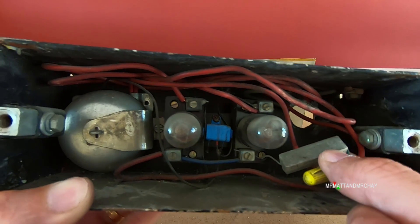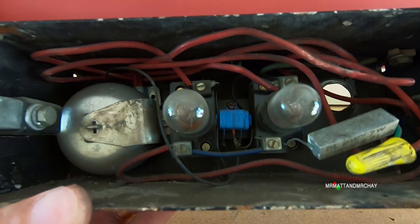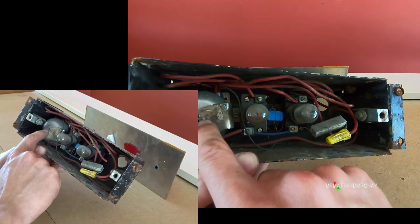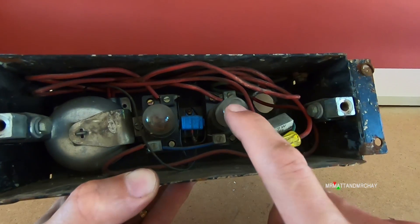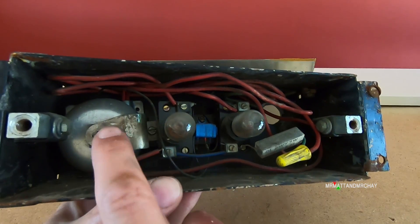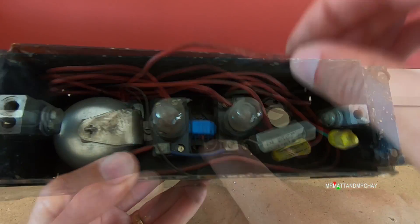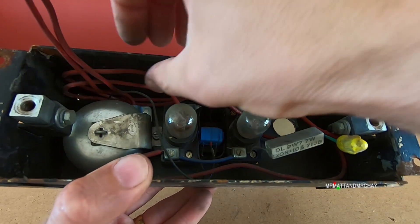So that Z-shaped piece stops the light from coming out of this segment into the next one. There's some kind of resistor in there. And then that unit in the middle — if any power goes to these lamps, that voltage is fed to the bell at the same time. So if I connect voltage to this bulb, the bulb would light and the bell will activate. And if I do the other bulb, the voltage would also go to the bell, via that unit in the middle. Let's pull some of these wires out and have a look at what we've got in here.